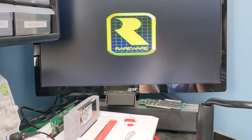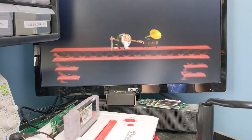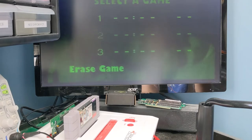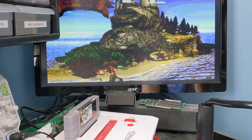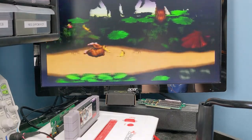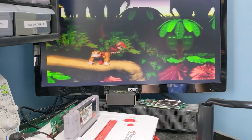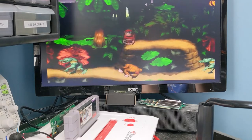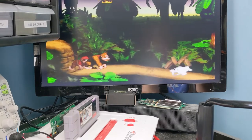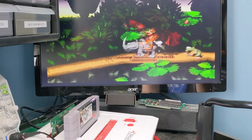I'm going to play through a bit of this just to make sure we've configured the RAM correctly. For Donkey Kong Country games, if you don't give it 16K of SRAM it's not going to start up — it'll throw an error screen. It looks like it's working. If you run into any problems like it won't start up correctly, double check the board, make sure you don't have any short circuits, make sure you have the correct parts in, and make sure you have all the solder pads soldered correctly. All of this — the whole guide, example part numbers, and troubleshooting tips — are all on my website. Hopefully this is a good overview of how to make games with this board: not just multi-carts, but single games and EX Hi-ROM and EX Lo-ROM games as well.